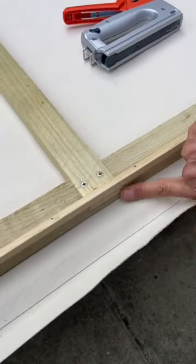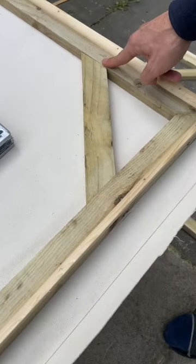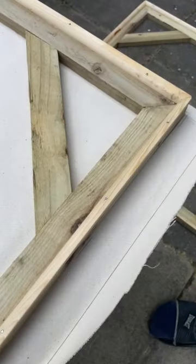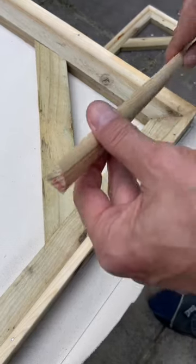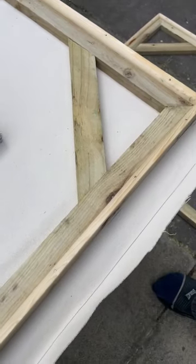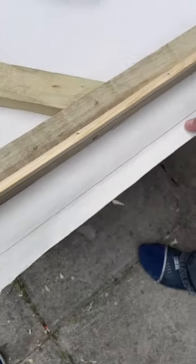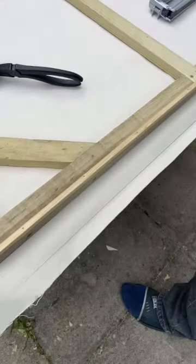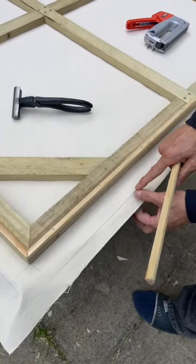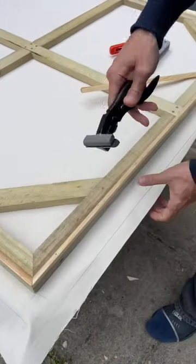Our joints are all nicely made, a couple of screws in, planed off on the edges, glued up nicely overnight and left clamped to the table — left to glue in one plane so that the stretcher doesn't twist or warp overnight. We've mounted a three quarter inch quarter round beading on top, glued and pinned, and that keeps the canvas off the stretcher bars. Around the edge we've got a pencil mark — that's a very important part of the process so that as you stretch your canvas over onto your stretcher you get a parallel line; otherwise you'll stretch unevenly and that's where you'll get bubbles, warps, and cracking in the surface of your canvas.